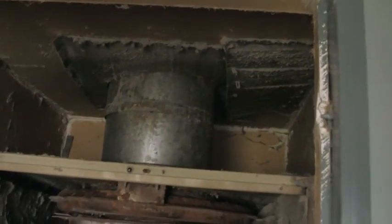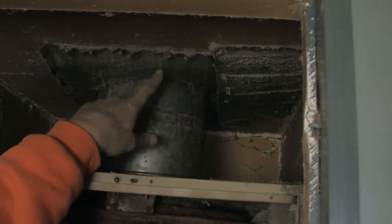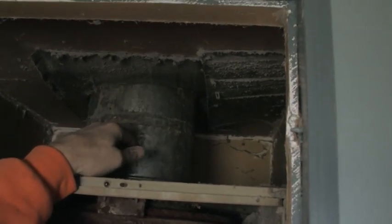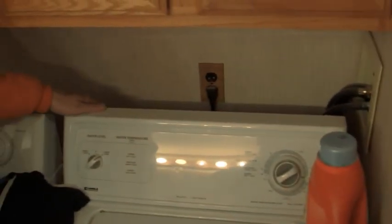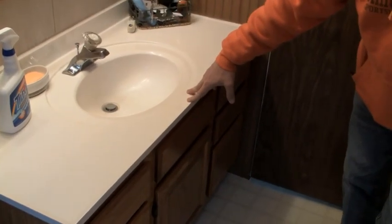Right now, all we're really looking for is a couple of points where insulation would get into the mobile home while we are insulating. Some of the more common penetrations where insulation can get into the structure is this collar right up here — many times it's missing and there's a gaping hole. That should be fixed before you insulate the attic. Another common entry point when you're blowing the belly is right behind the dryer — many times there's quite a large hole cut there. Also, beneath sinks and around the bathtub, they sometimes go right into the water heater closet and down into the belly. Check underneath your sink and by your bathtub where it goes into the water heater closet.